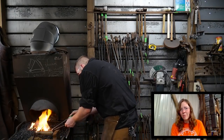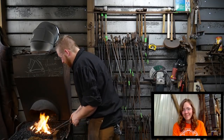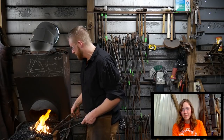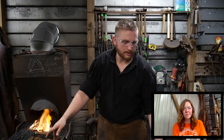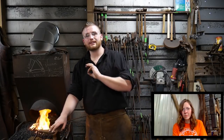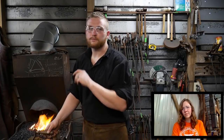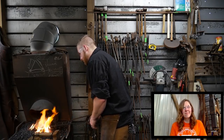Jump off the impaler says, I did not know this, that you should not coat the entire piece in flux like a madman. Nope. If you flux like crazy and drown it, you can actually cause the weld not to stick, because too much flux gets in between the surfaces. A lot of people have a problem with properly scarfing their joints. If they don't get that scarf just perfect, so that it blows out the flux, the flux gets an inclusion in it, and then it pops apart the joint at a later date. You can actually bake that flux on there. Again, you're supposed to just throw it on. It's supposed to eat away at the scale, not just be a caramel topping. If you want caramel topping, go get an ice cream sundae.